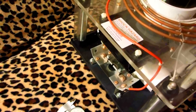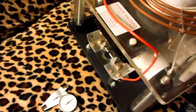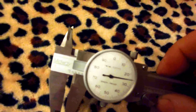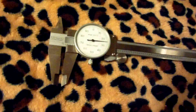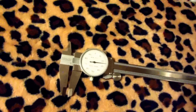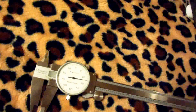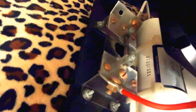I guess maybe I wore down about ten or fifteen thousandths after a few months of using it about an hour a day, so it takes quite a long time. I just readjusted it — brought it from 130 thousandths back to 125 thousandths, which is the factory specification. When it gets up to about 135 thousandths or over 130 thousandths, I'll bring it back down again. That'll make this thing last a lot longer. Those tungsten rods will get eaten up after a while.